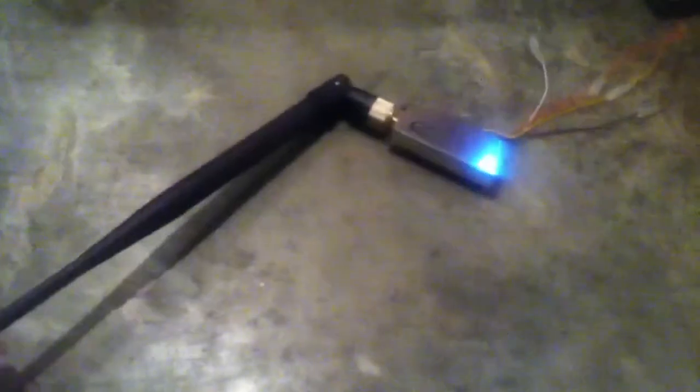You might be wondering where the case is — I took it out. The case is pretty heavy; it weighs about two ounces, and the actual transmitter with antenna also weighs about two ounces, so the case is roughly half the total weight. I figured removing it saves two ounces. One thing to be careful about: the case acts as a heat sink, so without it make sure you have the transmitter sitting on something cool like cement, or on a plane with good airflow so it doesn't overheat.